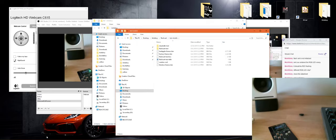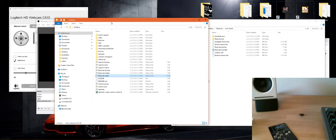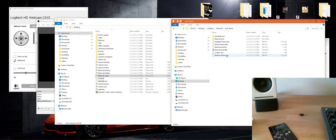And so the way that we use the flash utilities, there's two ways you can use it. You can use it from the command line, but lately what I've been doing is after you install Python and set it as a path directory, you can just drag and drop what you want. I don't know, does this need to be reset? This probably needs to be in the bootloader mode. So I'm going to drag this bin file, not that bin file, this bin file, because it's small. This is the sprite data for the ball test game. So we'll go ahead and flash that one on there. And the way we'll do that is drag and drop that onto this flash cart writer Python script.